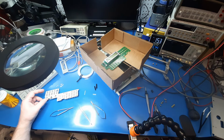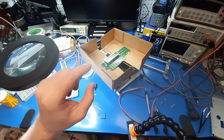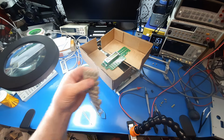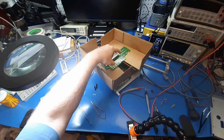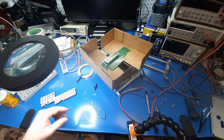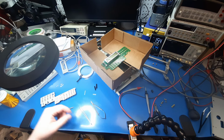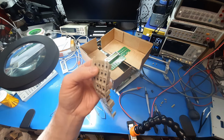There's, I believe, someone on EEV blog who's made a solution. Basically, he made 3M adhesive little carbon dots that you can put over these switches, and they won't touch, they stick out, and then when the button contacts them, you get contact. On AliExpress or eBay, you can also get little conductive rubber buttons that you can then glue onto here.